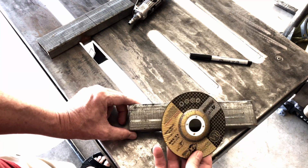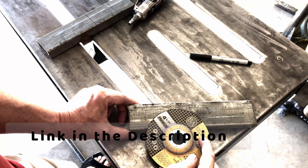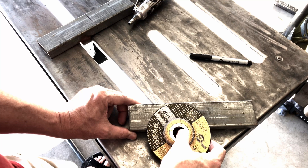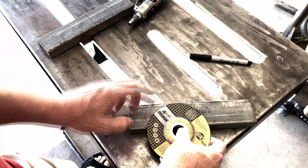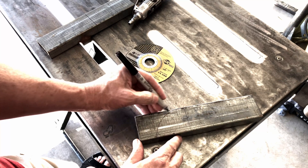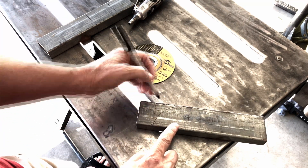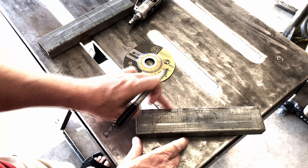I'm going to take one of these Benchmark Abrasives cutoff wheels — my favorite cutoff wheels. I'll put links for these things in the description if you're curious about them. They're affordable and they work for me. I'm just going to use that to draw a radius along here on both sides, cut right down the edge, then cut out this radius and cut this off flush. Do the same thing on the other side.